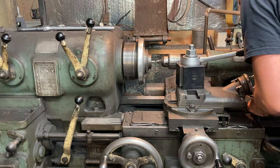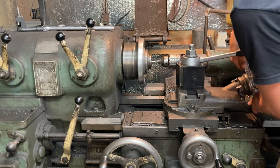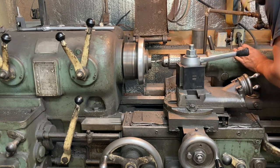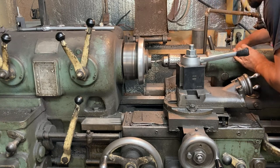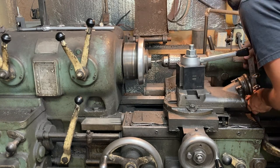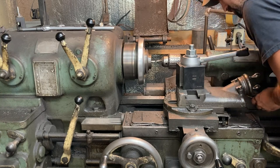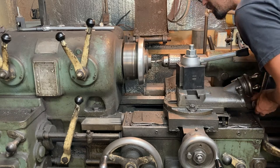Yeah, let's get our chuck adjusted too. I actually fiddle with tailstock alignment fairly frequently for drilling holes. I don't treat the tailstock alignment as sacrosanct. Either my chuck's lined up or it isn't. I don't want to be drilling an off-center hole. Well, I'm just doing the tailstock. I can realign it for whatever other mark if I want to.